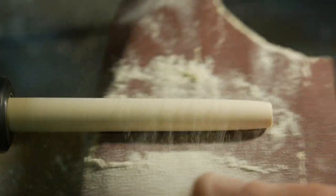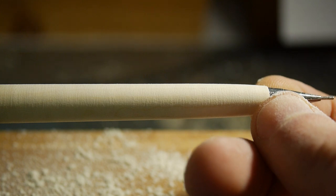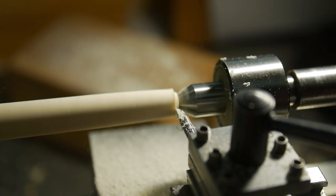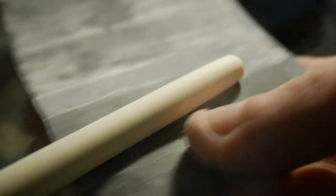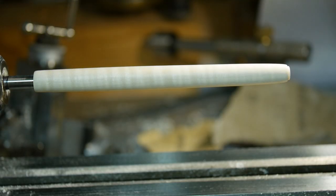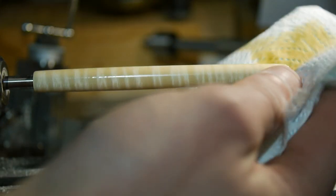Even with tailstock support, the middle of the pencil will have a tendency to flex during cutting. A 6mm diameter boss, 1mm long, is then turned on the end of the pencil to help locate the tip. Up to this point, the pencil is gripped in the collet. Now, using the drill bit as an arbor, the eraser end of the pencil is shaped, and the remainder of the wood is smoothed with fine sandpaper ready to accept the finish.